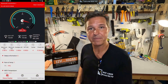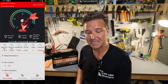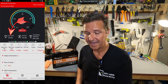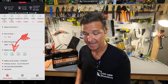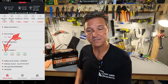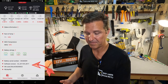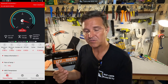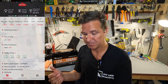Right now we're charging the battery and it's at 89.2%. We're using a 20 amp charger and the current is 19.4 amps going in. The battery voltage is 13.6V, and it shows the minimum and maximum voltages of each cell. Scrolling down you can see individual cells — the blue one being the lowest voltage and red being the highest. It also provides the serial number, software version, SN code, and temperature information. This app is easy to use and covers all the basics.